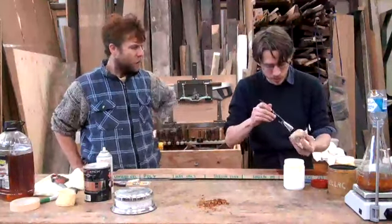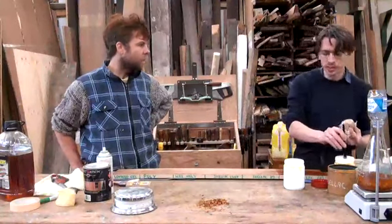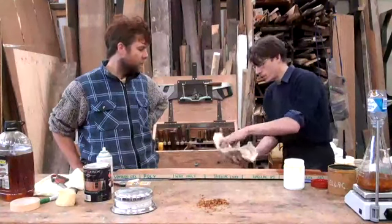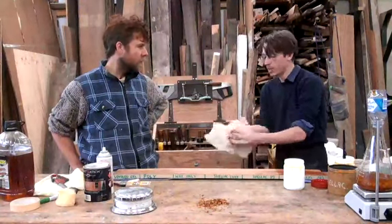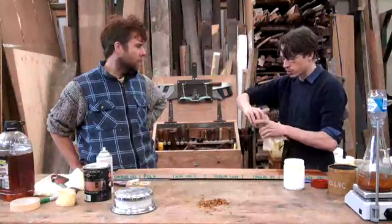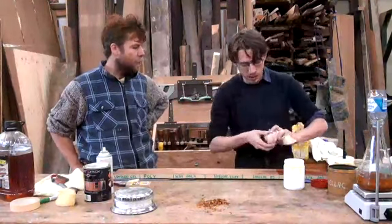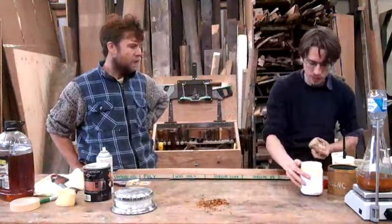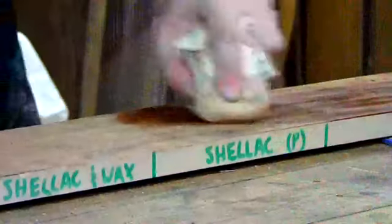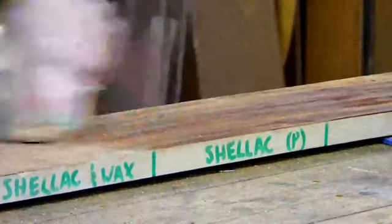So that cloth in the middle, you don't get it wet first, I think. There are so many ways of doing this. Some people will open this up and then pour the shellac into the back here. That way it's always filtering through the front, which definitely makes sense, particularly historically, when you wouldn't be able to have alcohol this refined. But in this case, I just put it on the surface. Just a little bit. You barely put anything on there. When I'm starting, I don't really put a lot on, and I'll add more as needed.